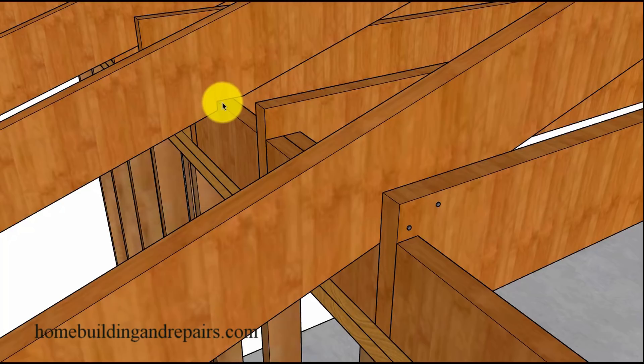You're going to need something underneath a rafter — whether one block or two blocks I'll leave up to you. It's a good idea to nail the joist every four feet on center if you're dealing with 16-inch on-center lumber, or nail to every rafter if your rafters are spaced 24 inches on center. If your rafters are 16 inches on center, make sure you put a joist right next to each rafter.